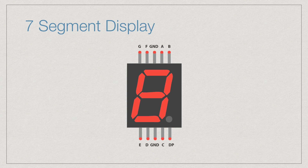The very first thing I'm going to do is create a circuit using a seven-segment display. Basically, a seven-segment display can represent individual numbers, as you may have guessed. A common cathode display, which is what I'm going to be using in this tutorial, has all of the cathodes connected to ground. These are all LEDs, and you turn on a segment by supplying current to an anode. As you can see right here, the pins are labeled starting at the top left and then going clockwise.